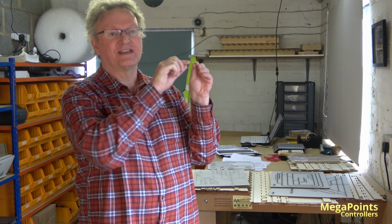We've got 2 entirely new systems. One is a system based on a CAN bus, and for Pete's Fiddle Yard this year we've got something like 120 blocks on it. So there's a ton of blocks on it, and we've linked it up to something that looks a bit like an NX panel, in that you have the whole sections of road lit up in white when the route is set, and then you have the occupancy showing in red as the locomotives move around it.